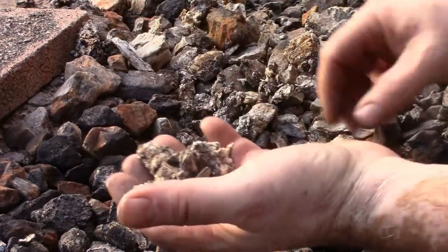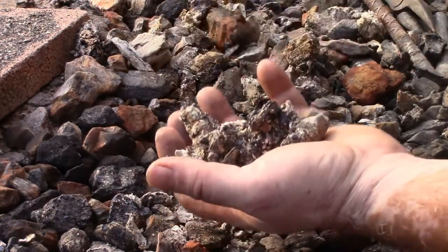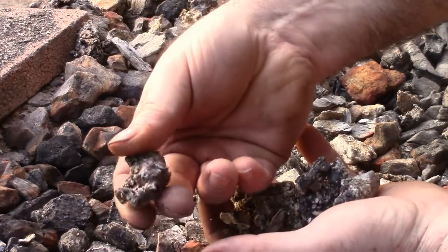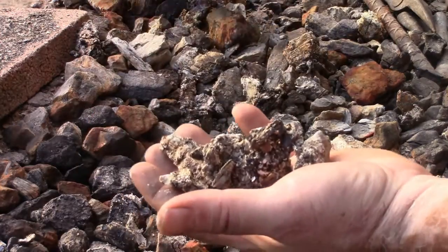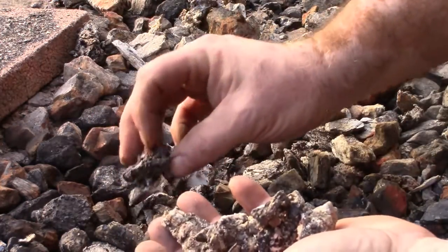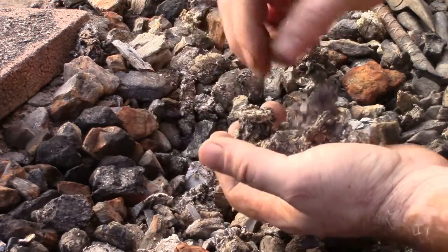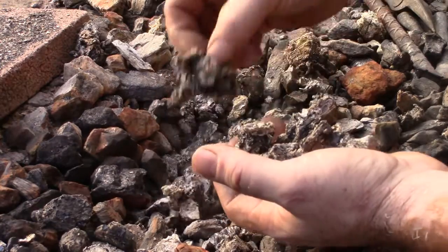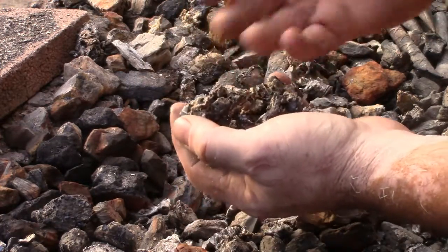So with the anthracite, you get a lot of this. I don't know if I'd actually call these clinkers. Clinkers to me are more of this brown color, looks like melted crap. These, I don't know, it's just sort of like worn out coal, but I find them all over the place, and you sort of have to watch for them when the fire's going. This is what you're watching. When I say stir the fire to move the clinkers around, this is what you're after.